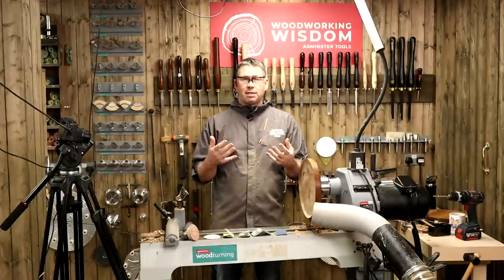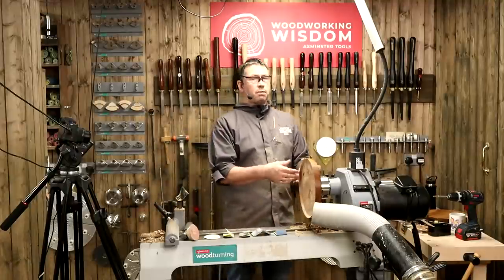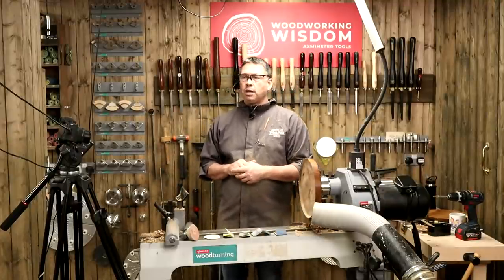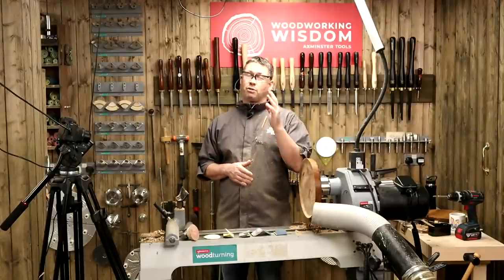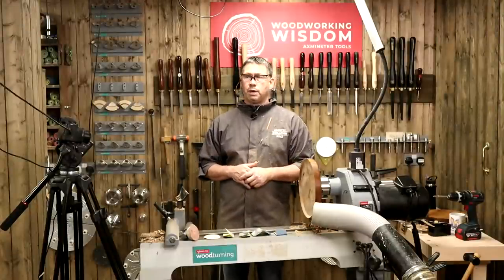Like I say, it does massively depend on the project. If you're making a piece of wooden fruit, you want it to be shiny. If you're making a salad or fruit bowl, they tend to be less so. Grade it to the project that you're making. But yeah, good luck with that. Dry it. Make sure you dry it very slowly, otherwise it will split on you.